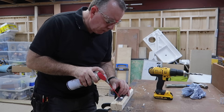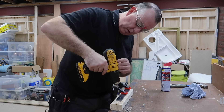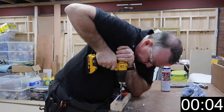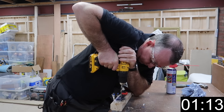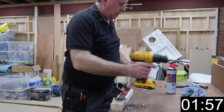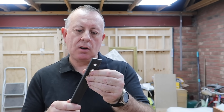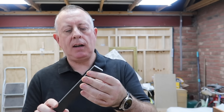No YouTube drilling video will be complete without an assessment of how long it takes to drill a hole. So here it is — another example from start to finish, without any interruptions. We're on the low speed, plenty of pressure, and go. And that is that. So I think you can see by that I had to put quite a bit of my own weight behind this drill to put enough pressure on to cut through successfully. As long as I controlled the speed, I wouldn't ruin the drill bit.